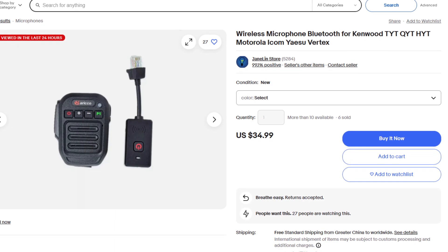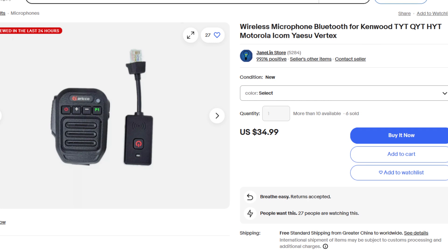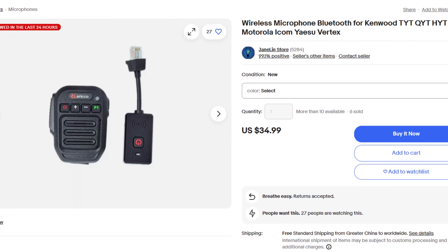The other thing I should mention is this version has the Kenwood 2-pin hookup, but there is another version with the same receiver/transmitter unit that instead of the Kenwood 2-pin has the RJ style — almost like a phone cord style — connection. That plugs into a lot of mobile radios. For example, I've got a TYT mobile radio, like a 50-watt mobile radio which I'm using as a base station radio for my VHF stuff, and that's got that RJ connection. You can do the same thing if you just order the different version of the wireless mic with the different connection.